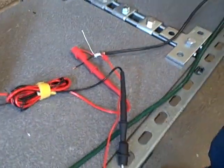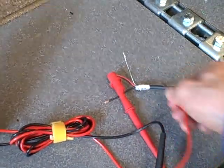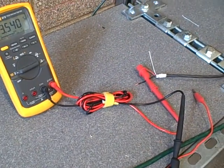So if you had this connected in the field, all wired up like this, and then suddenly you lost your ground connection, you're facing a lot of noise between those conductors and earth ground — possibly corrupting any data that you're going to receive.